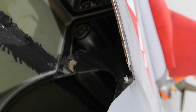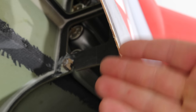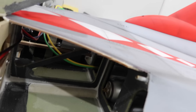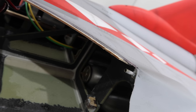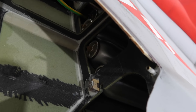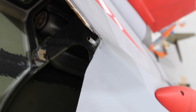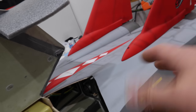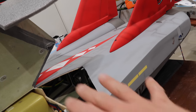In sorting out the back end here, I'm just taking a look at the air tanks. I think what I'm going to do is run four of the air tanks across the forward section right here. I could put them back further, but the problem is that you've got airlines exposed to possibly the heat, and there's more room the further forward we get. Wherever we put the air tanks, we're going to put a heat shield on the side and stick that to the side of the fuselage to protect those air tanks and airlines from the heat coming down the pipe. When you're organizing an area like this, you have to think about all the different systems working together and how they're going to interfere with each other.